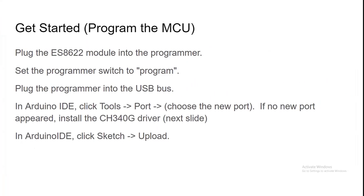There's a how. Oh, I didn't mention because it seems to work on my other machine, and I can't believe this, but there are still Windows installations that do not have a CH340 driver installed or available. I don't know why that is, but on this laptop, I probably installed it manually years ago. So in the programmer, in this guy right here, it's a serial to USB adapter, but this chip right here at the top is a CH340 chip. And that is a replacement for the famous FTDI chips. So if you have an FTDI chip, Windows will probably install a driver for you. If you get a cheaper Chinese one off eBay, it's going to have this CH340 and you have to install a driver for it manually, probably.